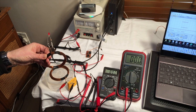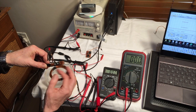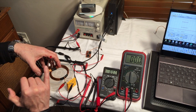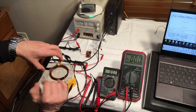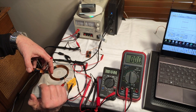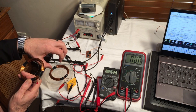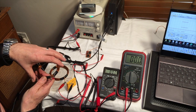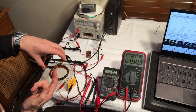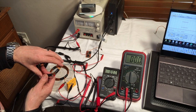So here we have the receiving antenna. The receiving antenna consists of 50 turns of enameled copper wire. At the end of each part of the electrical conductor, I've attached the crocodile clip, and I am attaching a light emitting diode to the end. This over here is a current resistor, and I'll explain a little bit more about that just now. An alternating magnetic field is going to induce an alternating electric current in the electrical part, and the LED is going to show us when a current is being induced in our receiving antenna.